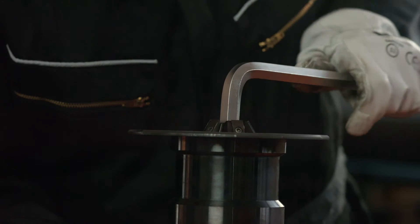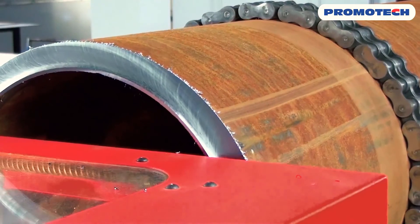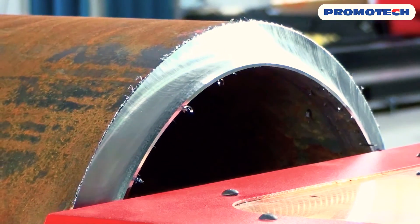The machine we delivered was a great solution for all of this. Depending on the regulations affecting your jobs, the geometry of the bevel required can vary. Often a 30 or a 45 degree bevel is sufficient, but in some applications a j-bevel is needed.